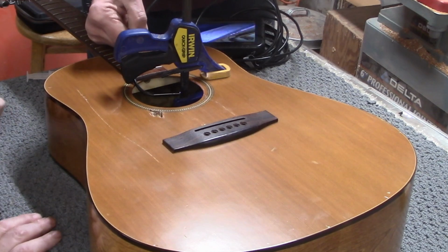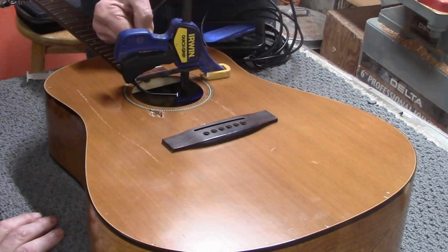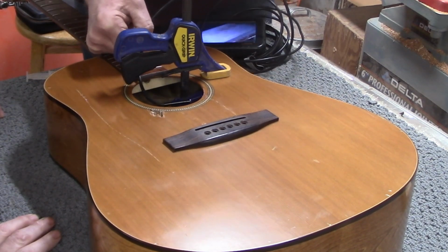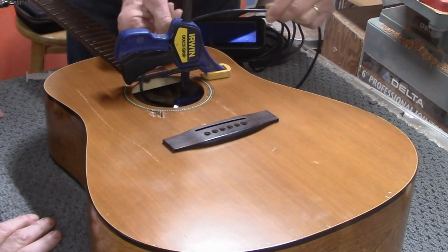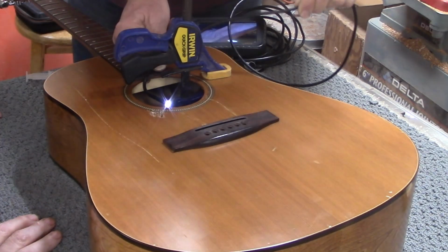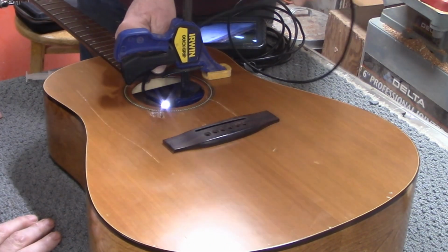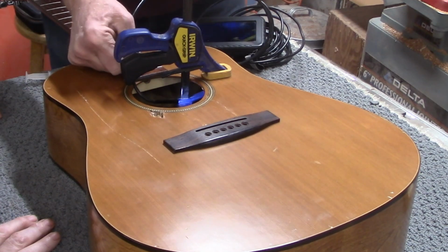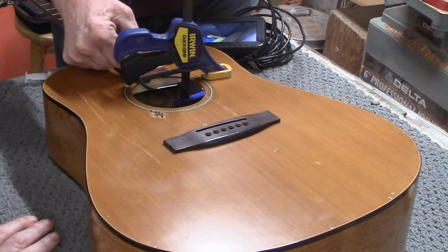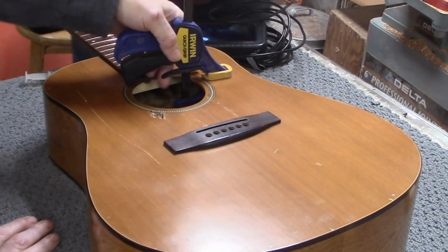Well, if you look at the brace itself, well, that one looks better. Some of this brace over here is more flats on than quarters on. Right, yeah, they didn't necessarily select the best woods. It's going to be more likely to split. So it may have just been the nature of the wood to some degree. Here, let me pop this out of the way for you.